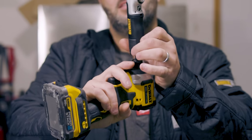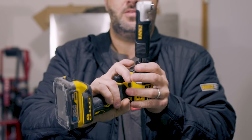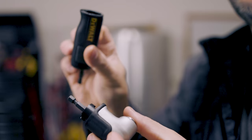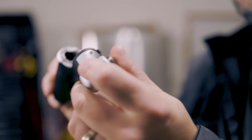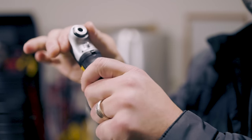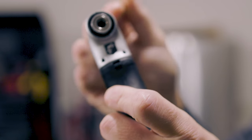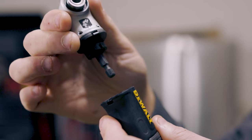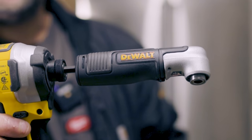Right off the bat, this allows you to turn this item into a right angle attachment that you would use with your impact drivers. You take this piece and this piece, put them together like so, then turn it and it locks. If you want to remove this piece, push up on this little tab, rotate it, and pull it out. That's obviously one way to use this right angle — but it's a 4-in-1.